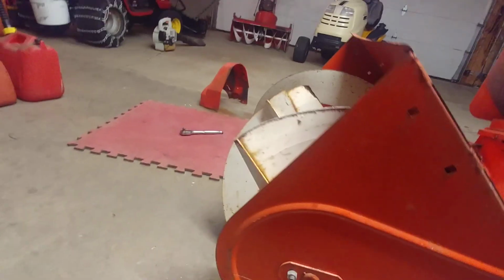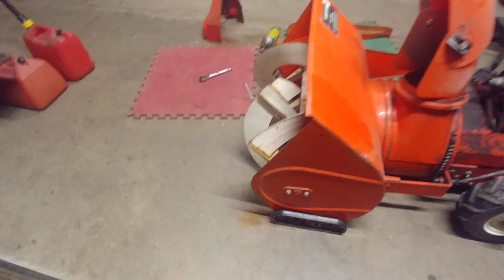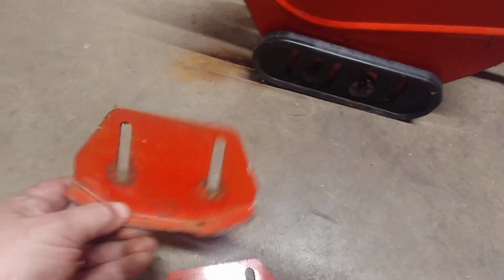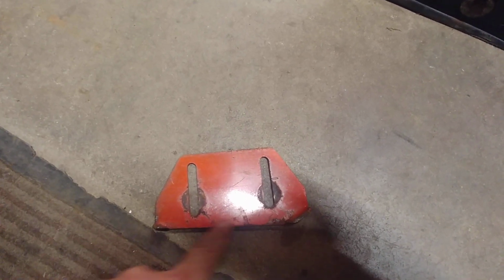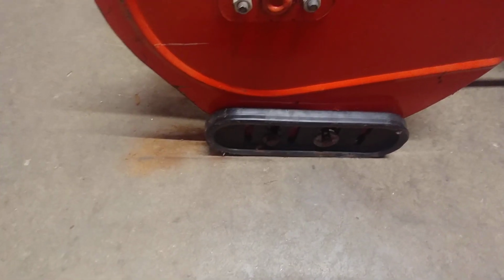it sticks out from the safety third, and then the skids on it were pretty well toast. Somebody ran it too long like that. So I had these laying around. Sometimes I weld some metal on these. You can see how it's worn at an angle here. Sometimes I weld angle iron or something on those and let them buck. But I had these stupid things.